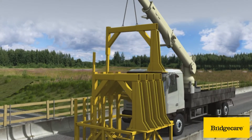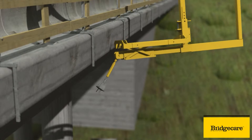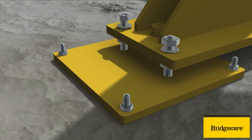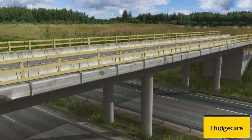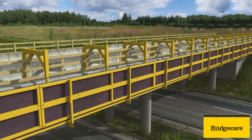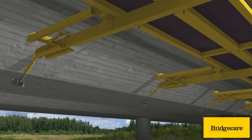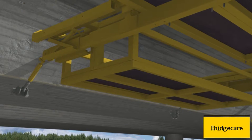The trestles are lifted from the vehicle to plates that have fixing bolts for them. After this, the walking platforms are erected. The work stage proceeds hand in hand with the installing of the railing, so a rail is always installed after a part of the platform is installed. Next, the parallel installation platforms are installed. They are placed on the forks of two successive trestles.